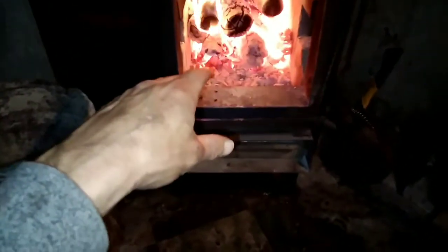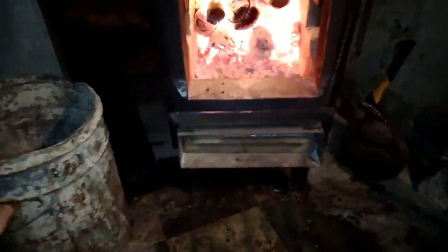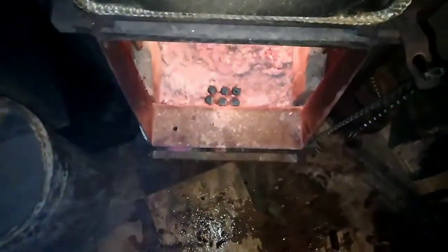And then I put a new floor in the wood burner. It was perforated all the way through, so that was allowing air to sneak up and really just torch the coals. It would get extremely hot, but it was getting so hot it was blowing up bricks, and it was burning out the coals faster than I want. So I put a new solid piece of steel in there, 3/16 inch or something like that. Then I drilled six 1 inch holes front and center, so all of the air that comes in is coming from only front and center when this door is closed. It's really making the air tumble inside of there before it gets sucked out the chimney pipe.